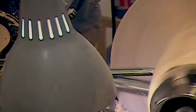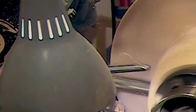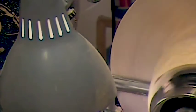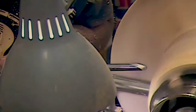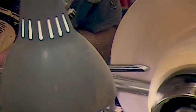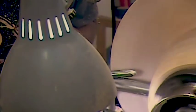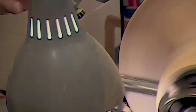But I discovered that big old bowl roughing gouge, fresh off the grinder, fits this curve really nice. And I can get rid of a lot of little ripples and things that this tool is leaving behind. I get the shape right first, and then I just grind that big steel and do a very light shear scrape and perfect it. See that? Oh, yeah. World of difference. Perfect for that shear scrape.